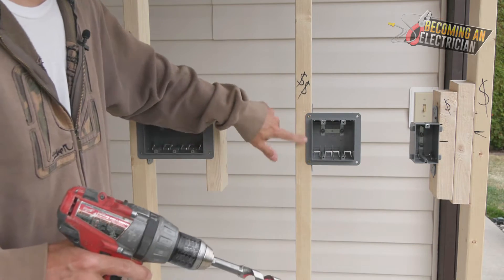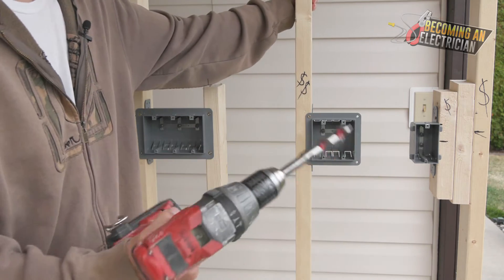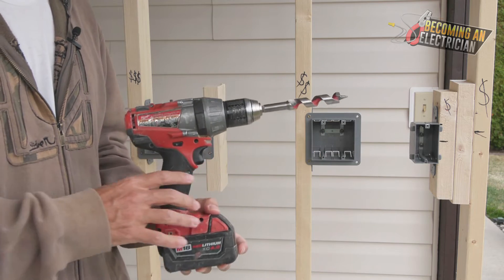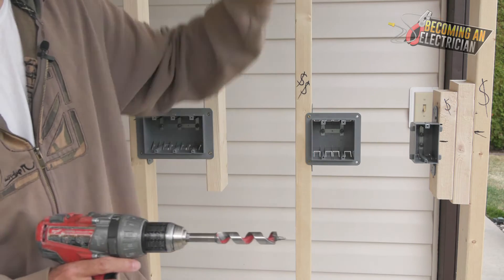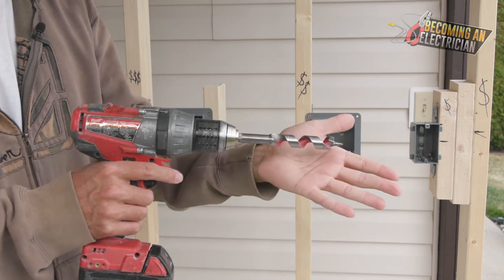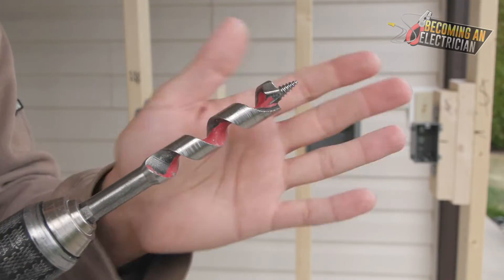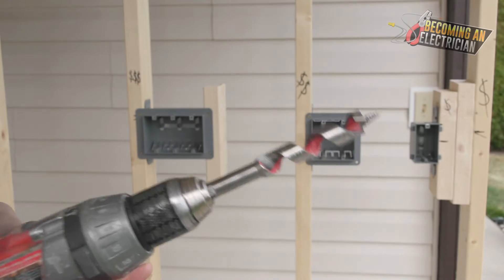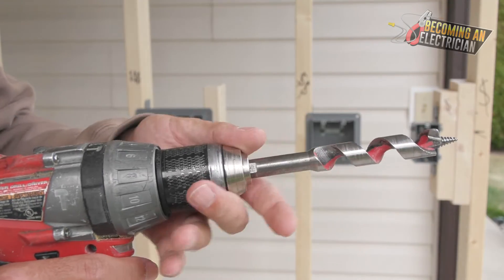For example, if we're just putting screws in, that's super lightweight on your drill. But if we're popping tons and tons of holes throughout a whole home, you're going to burn out your drill super quick. Typically a company will provide you a D-handle drill — I even worked at one company where they had really long handles so you're able to reach up higher in the joists. So this is called an auger bit. If it ever gets dull, you can actually sharpen them — just make sure to watch a tutorial on how to sharpen auger bits. An auger bit is super powerful because as it's drilling, it's actually removing the wood chips as it goes.